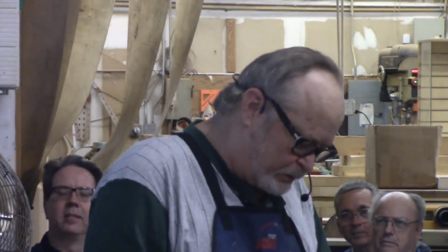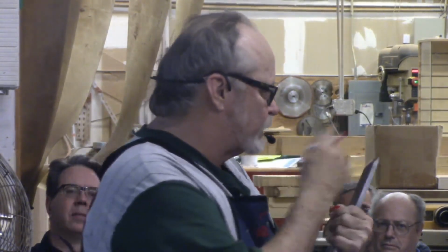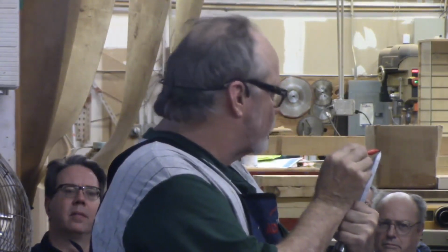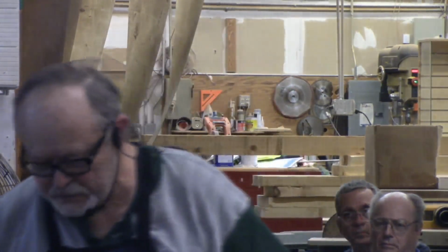Okay, so sharpen it like this. It's got a straight and then a curve. This isn't a radius skew. I hate a radius skew. It's actually got a straight section at the long point, at one-third to one-quarter length, then it becomes a curve. 70 degrees from point to point, 1.5 times the thickness, come back, etc. Full round, broken corners. Everything else is exactly the same. So when you sharpen this, here's how you do it.